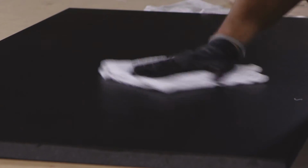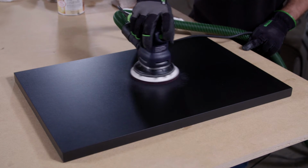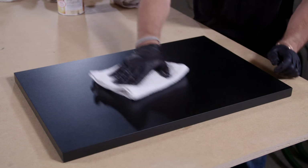Apply one coat, allowing 12 to 48 hours for curing. It can be put into use sooner, but it is best to leave it as long as possible. Full cure is after 48 to 72 hours. A second coat can be applied for a slightly higher sheen, but is not required. Osmo will blend into previous coats and can be used as a spot repair for both itself and Richlite Enhancer in the field.